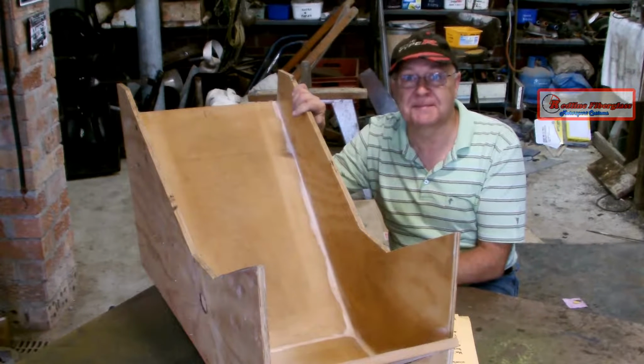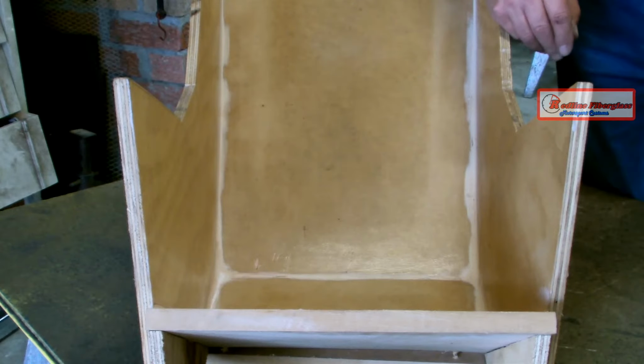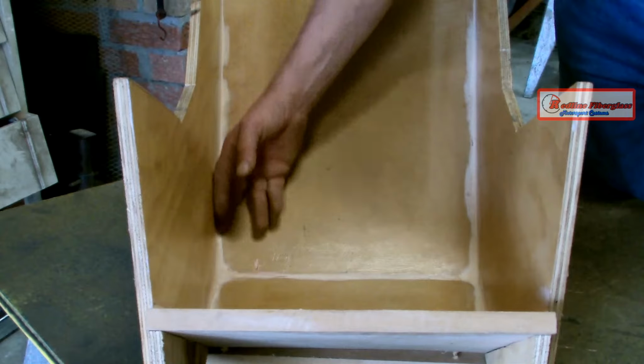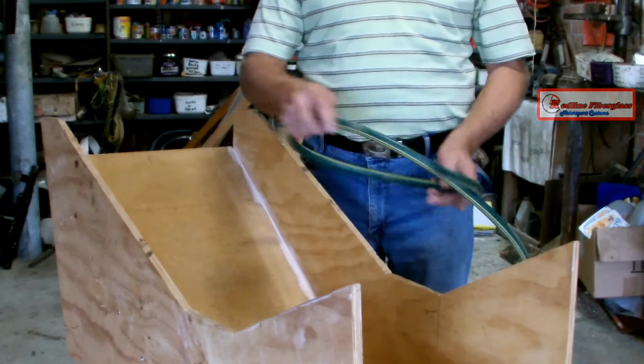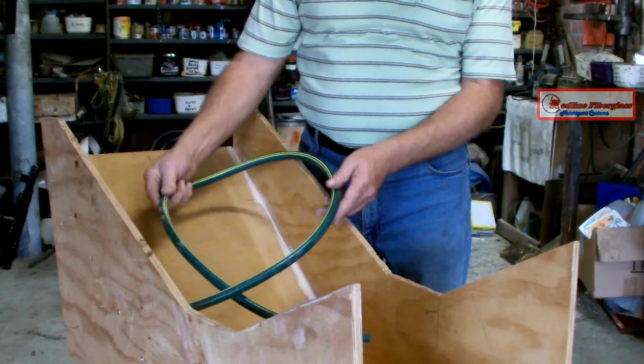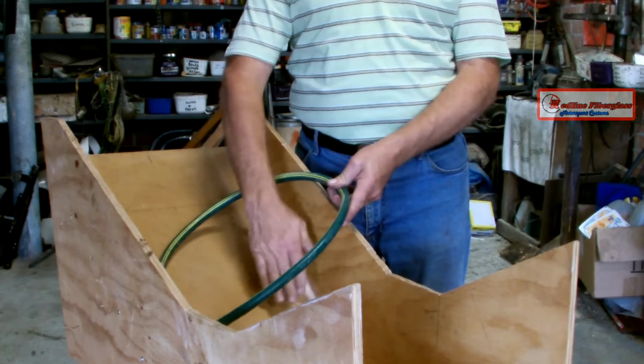I've checked my friend reclining in this timber dummy, and there's room here to round off these internal corners. I'm going to use the scrap garden hose and filler to get a smooth rounded edge. It's a technique I often use in sculpting car parts because it's an easy way to ensure that I get a constant radius.